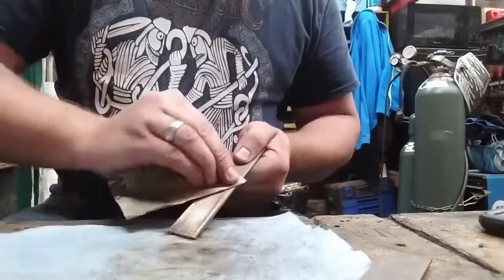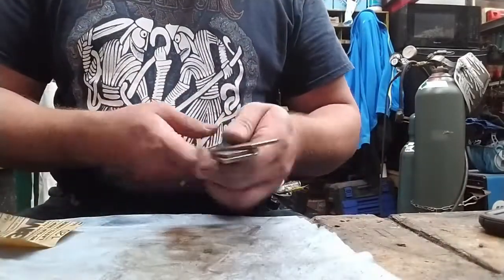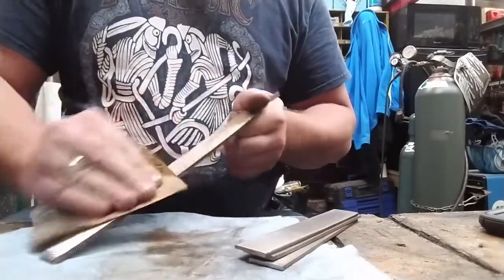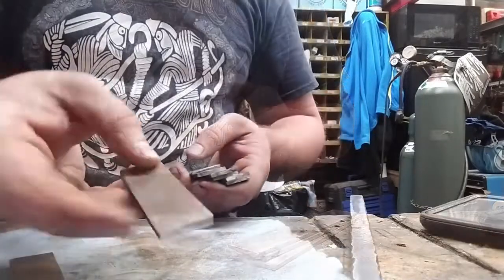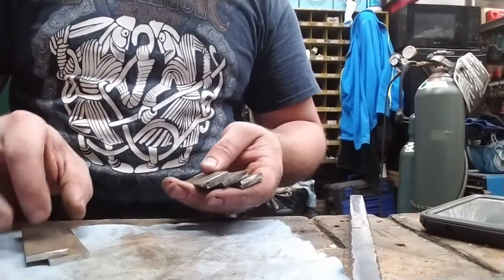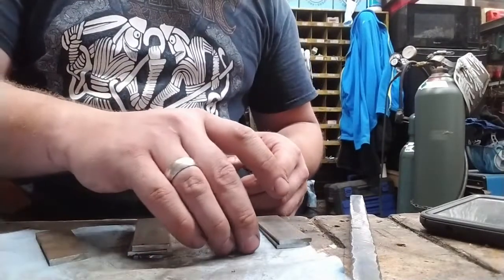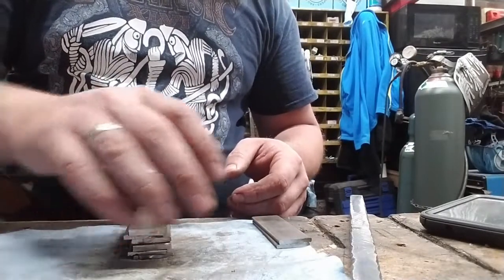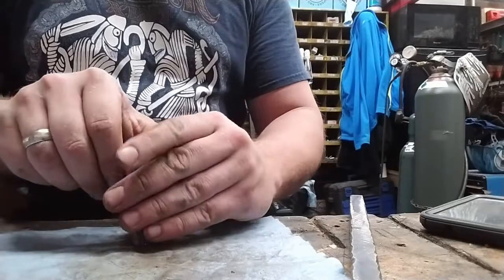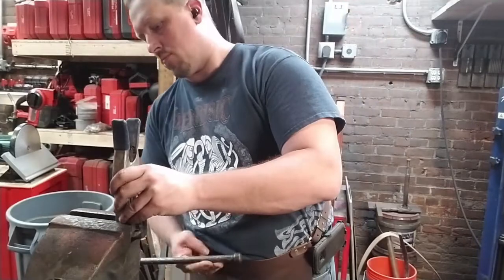And again, this is some of the steel that we went through the cementation process with, the steel that we made into high carbon steel. And we have a little bit of known good donor material in the form of this Nicholson Black Diamond file. And that's a very period process, not necessarily using files as parent material, but using known good and no longer necessary pieces of iron as a moderating factor when adding new steel. Because we don't know the characteristics of the steel that we made.